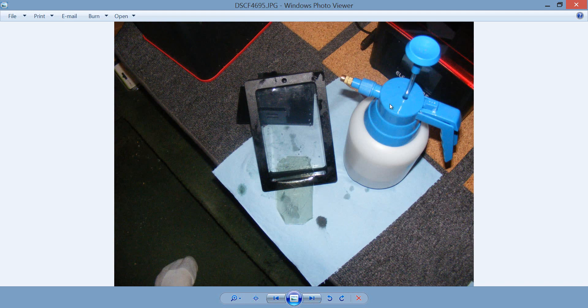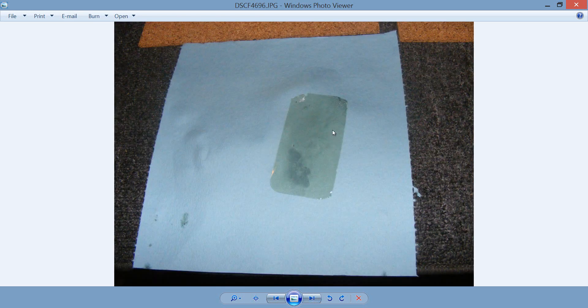I used this pump — one liter pump sprayer — and I sprayed it in here. You could do it before if you want to clean the little resin out. And once I cleaned it out and pulled the skim out, I used the pump sprayer and cleaned it out and just let it drain out. I don't even put a paper towel in there — nothing scratches this vat. Once I spray it really good, because it's got a lot of pressure, it blows everything out. I really don't need a paper towel, just shake it out a little bit, and when I'm done I put my resin back in. Here's the skim — and if you did any kind of printing earlier and it's got little droplets that get hard inside the vat, this skim will actually attach to it and peel that off also, making it really easy.